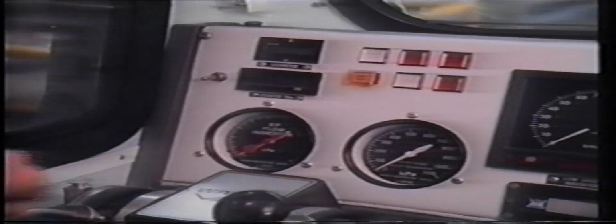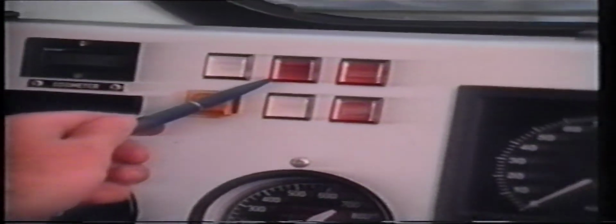There are 5 indicating lamps and 1 test lamp. Top left is the white wheel slip light. Next is the red manual power light. Next is the safety control lamp, which will light if there is insufficient brake pipe pressure. Below is the white fault lamp. Bottom right is the brake cylinder park brake lamp.